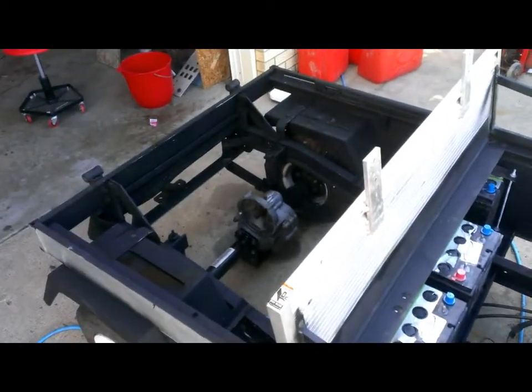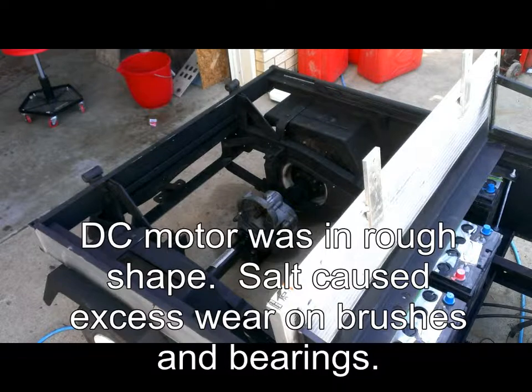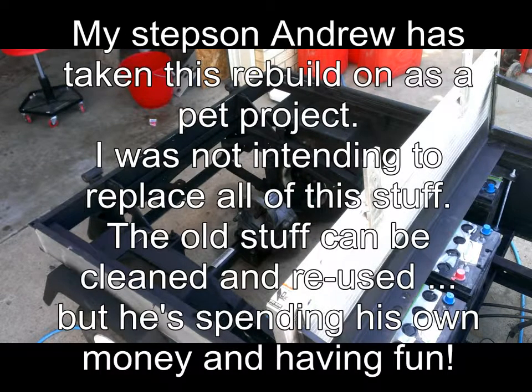In the back you will see the motor is gone. There is a little hole inside the gearbox frame — I don't know if it was intentional or not, but it let a whole bunch of crap into the motor. I've got some pictures I'll post; it was pretty nasty. It's what I would normally expect to see in a potash environment — the dust got in and just ate everything, and there is build up everywhere. The motor is going to take quite a bit of rebuild.